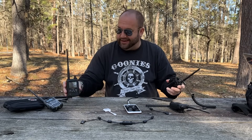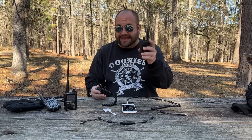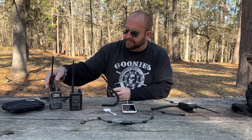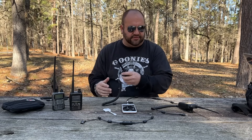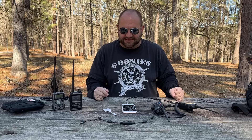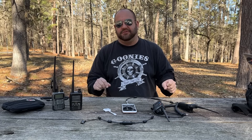Either way, I've got a bunch of other radios that I can use with this experimental Vox cable to send WinLink emails and position reports and things like that — this is freaking cool. If you've got an iOS device with an FT5, or a VX6 (I see more VX6s in the wild than VX7Rs), the Yaesu radios I've tried work, and the Baofeng works too. I can't confirm the ID50, so keep that in mind. But iOS users who still haven't converted over to USB-C now have a way to send WinLink with your phone using Radio Mail and the DigiRig Vox cable.